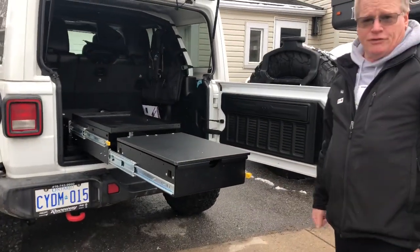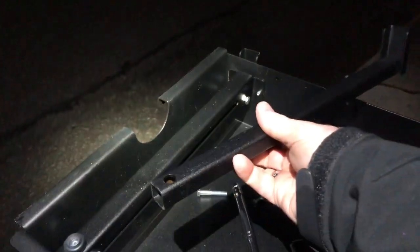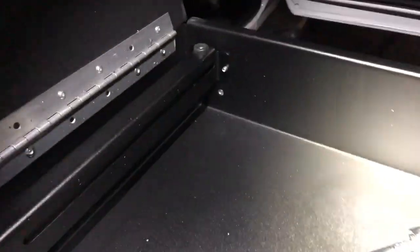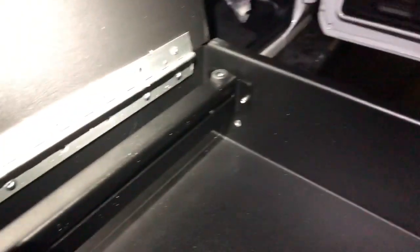We're ready for the fridge once it comes in. So we're installing the sink, and they come with two of these arms — excuse the light because I ran out of daylight. These arms go right into this opening. This one will go in there too. You have to use these little sleeves, and the sleeves go right in here. We're going to install the other side.